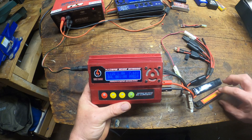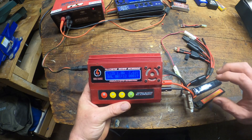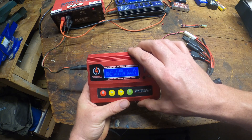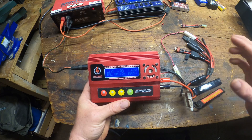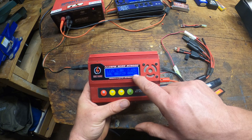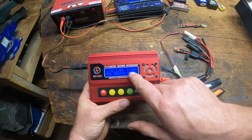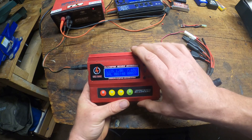It should finish at around 4.19 or 4.20 volts per cell — that will tell us we have a good battery. Also, if the battery feels like it's puffing up, the cells are puffing — the battery is probably no good anymore. These batteries are pretty robust, but you want to watch for that. The milliamps going into the battery should hopefully read around 700 to 800. We're charging at one amp because it's a 1000 milliamp pack. We'll come back and check it out.